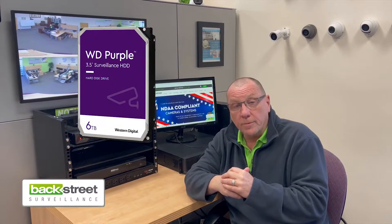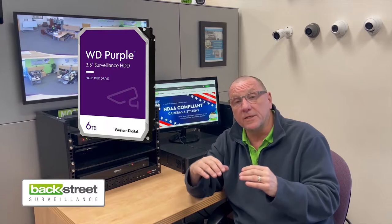All video surveillance systems use SATA hard drives — the standard PC hard drives that you find in computers. You've got to be careful with what hard drive you choose to use. If you use a standard PC version hard drive, it's going to work great for about a year, but they're not designed for the heavy workloads that 4K video produces. We use Western Digital Purple hard drives — those are designed for video surveillance, basically a server class hard drive. Pick a server class hard drive or one that is made for video surveillance.